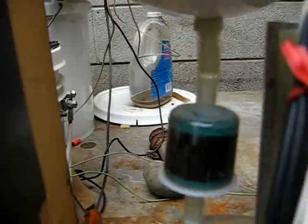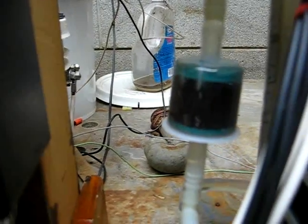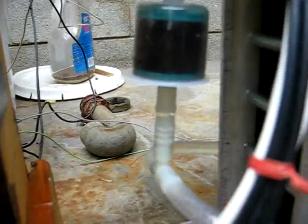We've got half a teaspoon per quart of electrolyte in there. The recirculating electrolyte comes out the bottom through an automotive three-eighths filter, comes through this split tube to the bottom. This is a Schedule 80 threaded coupler, a T here, threaded on all three sides, with nylon barbs with half-inch thread. Everything at least right there is half-inch. It goes down to a quick-release three-eighths filter so I can drain it — in the truck that will be about two feet long and come out of the bottom of the truck.